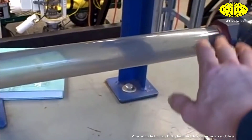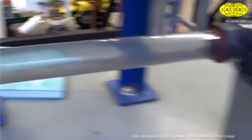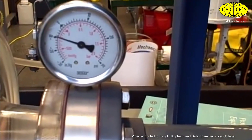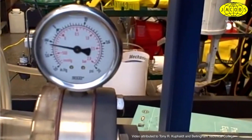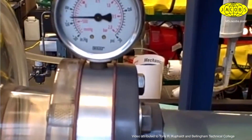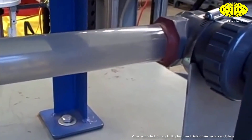You'll also begin to hear cavitation take effect. We'll be able to see the bubbles form inside as it cavitates — flashing into vapor and then cavitating back into liquid. So here we go, closing the valve and watching the gauge go down. Minus 10 inches of mercury. Minus 12. That's 14 — you can start to hear a flashing occur there. 16. More noise. Minus 18. Minus 20. You start to hear that sound that sounds almost like rocks going through the pipe.